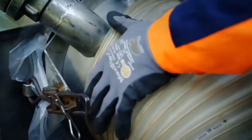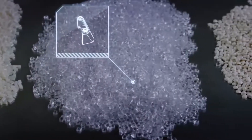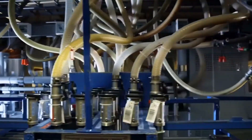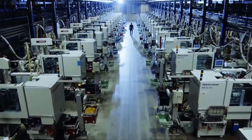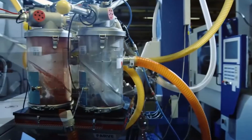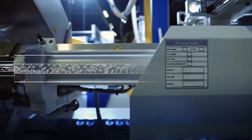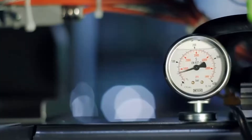Interestingly, the granules themselves are either colorless or have a white or black color. From the warehouse, the granules are sent to the molding section — the heart of production — where machines produce Lego figures 24 hours a day, seven days a week. The factory also has more than 50 different colors for the bricks. The raw material is heated to 230 to 310 degrees Celsius, becoming a homogenous mixture similar to toothpaste. This paste then falls into the stamping apparatus, where under great pressure, the famous bricks are created.